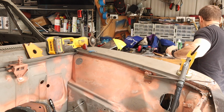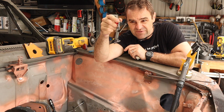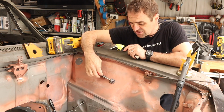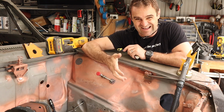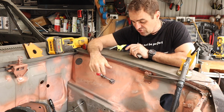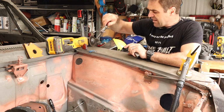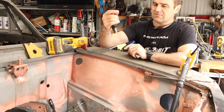So I used, ouch, still hot, this tool that some of you might have seen, which basically where you stick it on behind and you can adjust the foot of it. And this is a brass foot so that the weld doesn't actually stick to it. So you stick it behind the hole and weld around it. This is a great little bit of gear. I'll put a link in the description of this thing. And I started playing with this little thing.